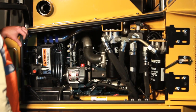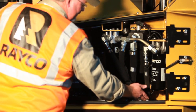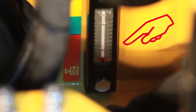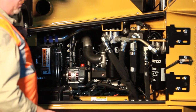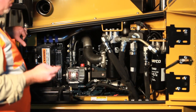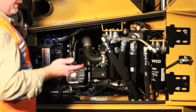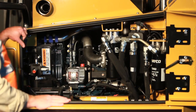The hydraulic oil level is on the right hand side also, just on the outside of the frame. It's got an indicator with a decal showing yellow, green, and red. The normal operating range is in the green; red means it's low; yellow means it's over full. It's a daily check and it has to be done cold. Once the machine warms up, it'll raise the oil level up into the yellow, and you have to be on level ground when you check it.